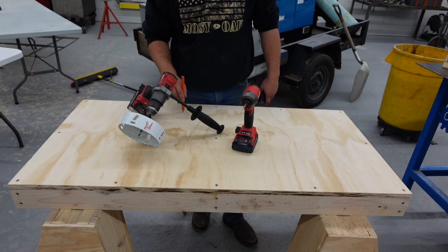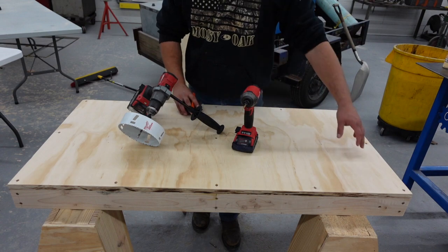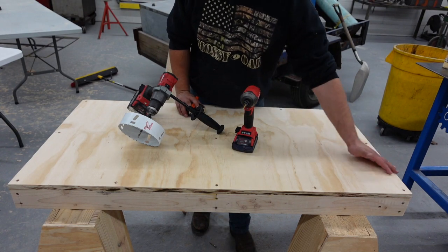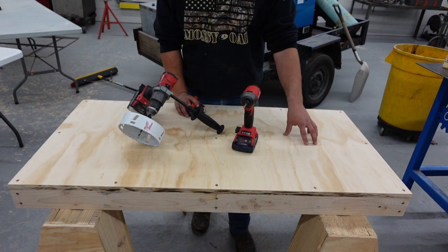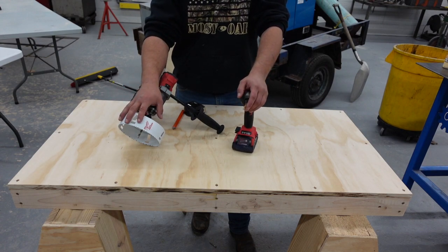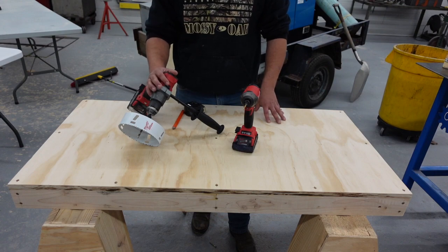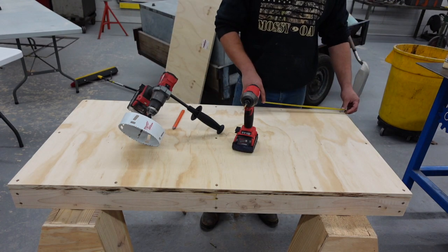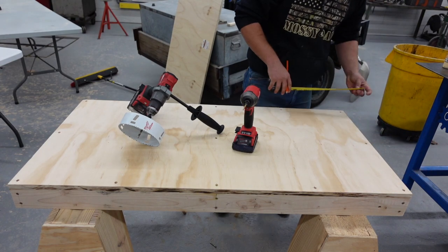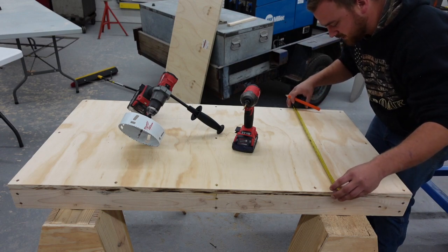It's been 24 hours since we glued our tops down. Now that they're fully cured, we can start working with these boards again. So what I'm going to do is measure out 9 inches from the top, making sure I'm doing it on the correct side — where the legs go — that's where we want our hole. We're going to measure down 9 inches and 1 foot over, so that's going to put it 9 inches down and in the center. I recommend using a pre-drill in addition to your hole saw. You don't have to use a hole saw — you can also use a jigsaw or a manual coping saw, but a hole saw is just going to be a little bit faster. Then I'm going to measure across using those reference lines to ensure I've got the right center.